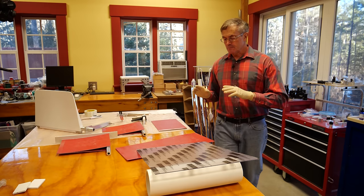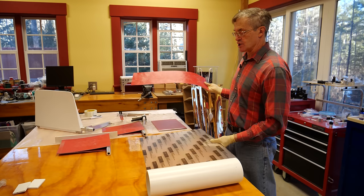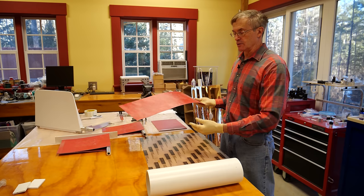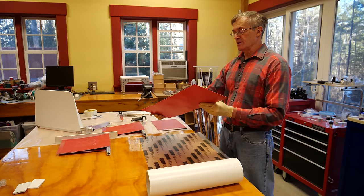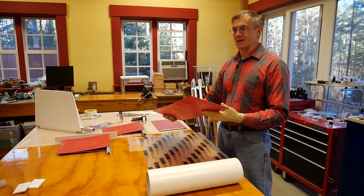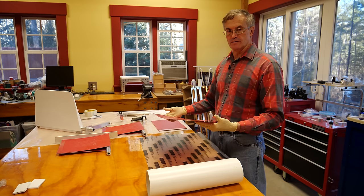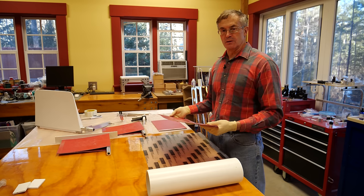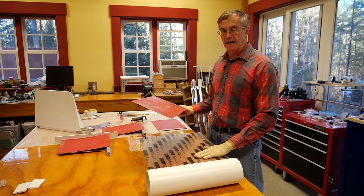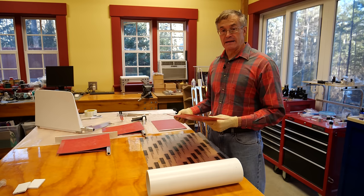One of the minimal requirements is that the sheets or material need to be as uniform and flat as possible so you end up with a symmetrical result. If you see this very thin piece of fiberglass, you can see the wobble and the twist in it. And if you get any of the big box plywood, you're going to see the same sort of irregular curves and twisting. You don't want to use material like that. You want high quality materials — you can use plastic, metal, wood, fiberglass, whatever you like.